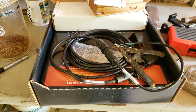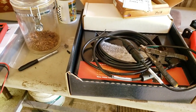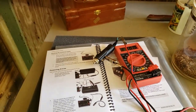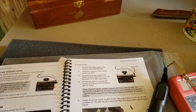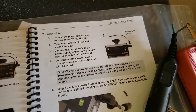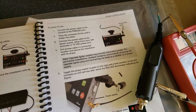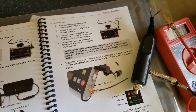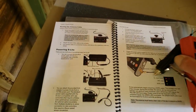I've been working on this for a while, got it physically installed out there on the tractor, and when I got ready to put power to it I realized something worth sharing — because maybe somebody might buy this unit. Read the instructions. In the gray area there: they don't recommend the cigarette lighter socket because it's sometimes intermittent — turn off the key, no power on the cigarette lighter socket. So you lose power, and I have a feeling you lose all your stored information. For a tiny farm like mine it won't matter, but somebody with a big giant farm trying to store information may be looking for some type of battery backup system.